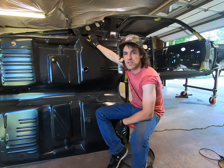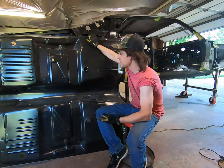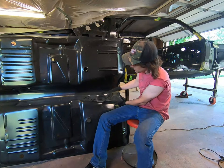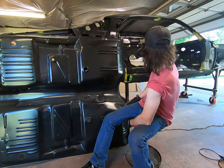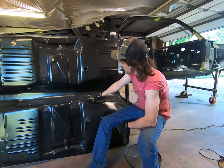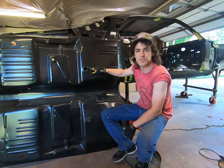Here's the floor pan I got from AMD several months ago — it's in good shape. I need to slip it inside, and this would be the front of it. If you had the floor shifter, this is where the pivot bracket and shaft goes through the floor — this is the tunnel floor. Your crossmember for your torsion bar goes right through this blank area. You put this in there and score around it with a mark. About a quarter to half inch inside of that is where your holes for your plug welds will be, so when you lay it back in the holes will be in the panel and you just weld it to the floor.